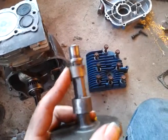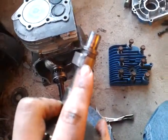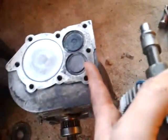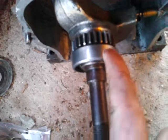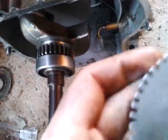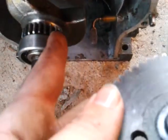And this is the same camshaft as I had in the last little clip that you just saw, but the other cam broke off — so it was kind of a good opportunity for this right now. But now I can't really show you the engine timing exactly as this version calls for, which is intake and exhaust using both valves. This is one of the 1977 Briggs and Stratton models that has the press-fitted ball bearing right here, so I can't really see the timing marks and I've had to time this myself. But on other engines, if you can see that little marking, it usually lines up with a marking on this gear right here.